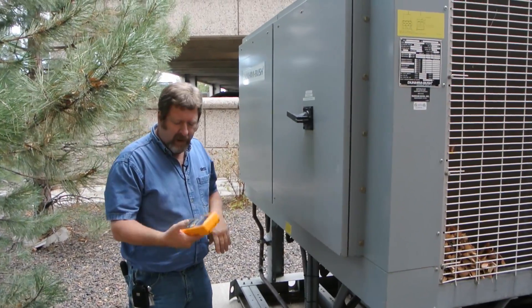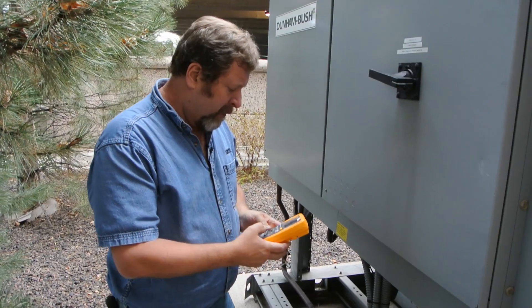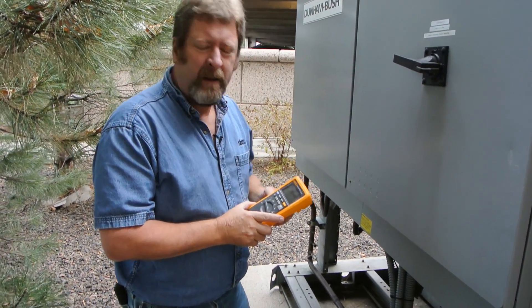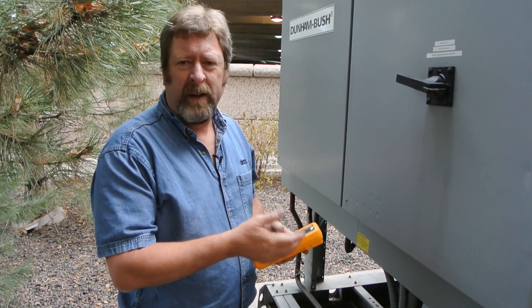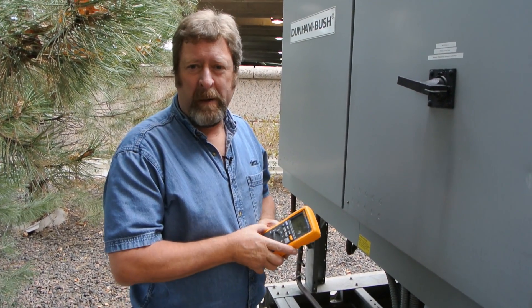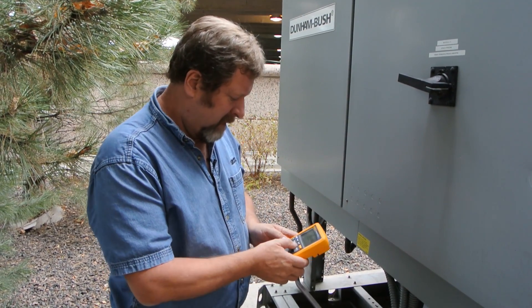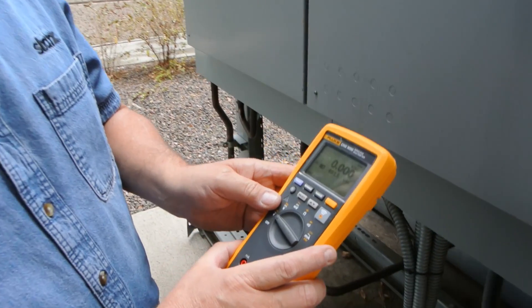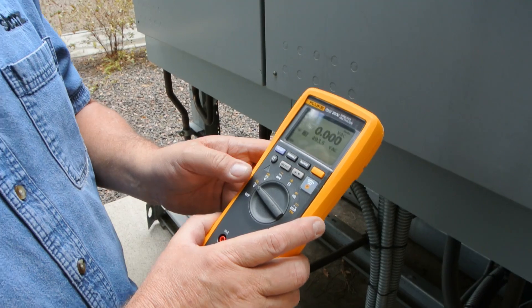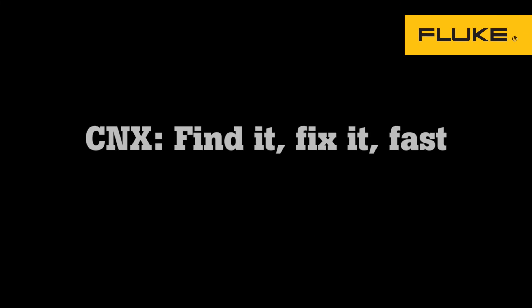With this re-energized, I can use the command module to read what the output is on the V3000 installed in the cabinet. Make sure it's operating properly before we leave it and go on to take a look at some other pieces of equipment we've installed and we'll monitor that. We've got the link there. We're showing 493.4 volts, so we know that's operational. We'll come back to this in a period of time and be able to log it and see exactly what happened.